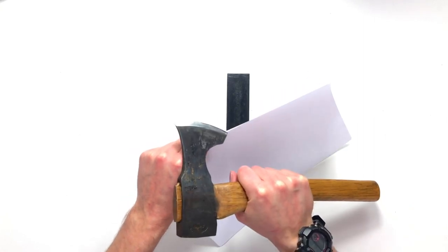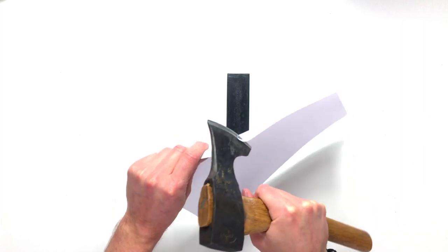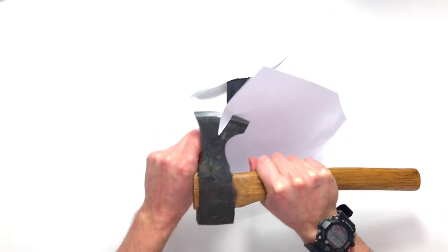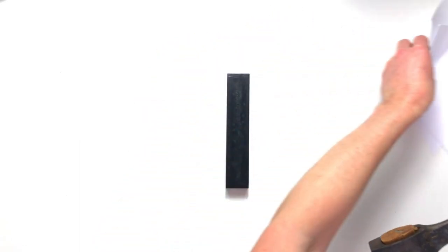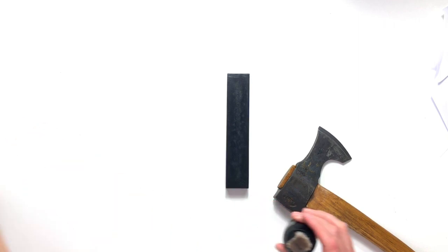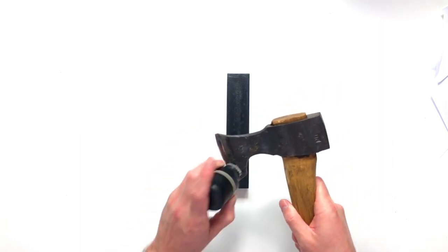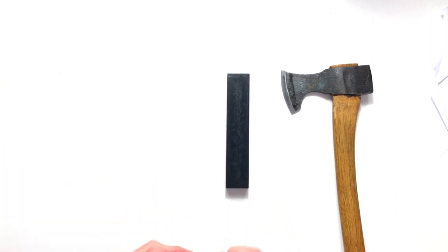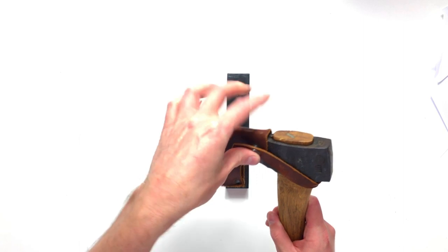Paper test: what we're looking for is that it can shave paper from one edge to another, and if it's very sharp you'll be able to move it around without any problems whatsoever. The last thing we'll do is pop a little bit of oil on here — that's just going to help reduce the chances of it rusting. Then we are done. Of course what we need to do is pop it back into its sheath and that is how you sharpen and strop your axe.